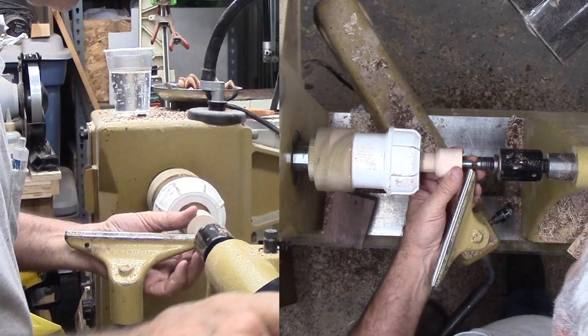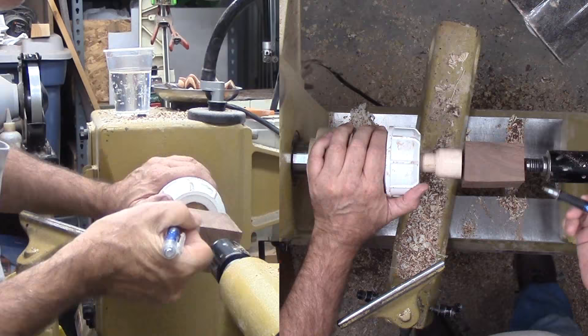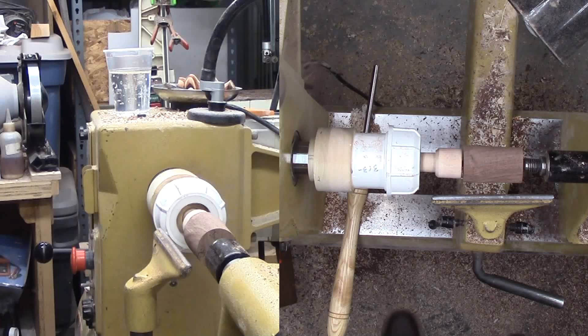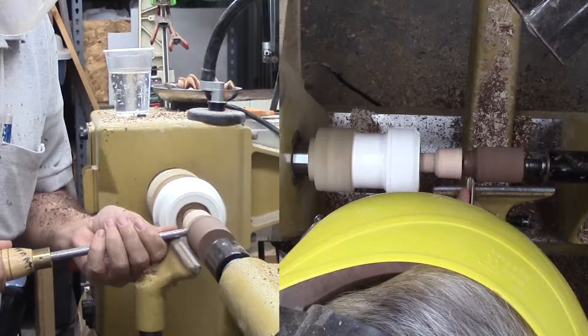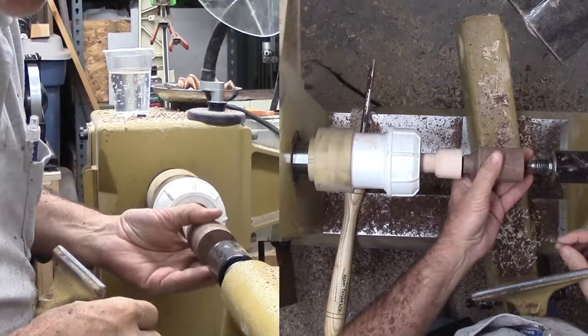Perfection does not matter, although I did try to tap it in with an Allen wrench used like a hammer. Then mount the walnut to the 3/8 inch screw. To start with, I'm centering the walnut for rough rounding. After rounding, I want to form a plain area that will transition from the steel base and contain the screw. No offset in this area so I don't risk exposing the bolt. I'll even sand it now.